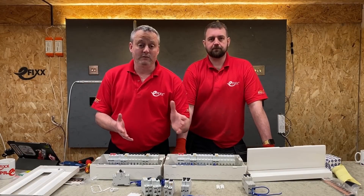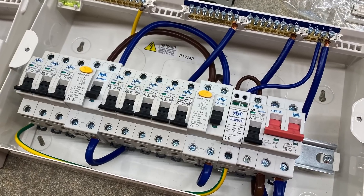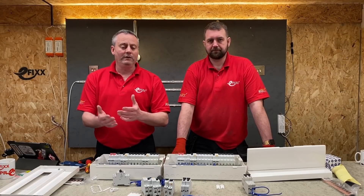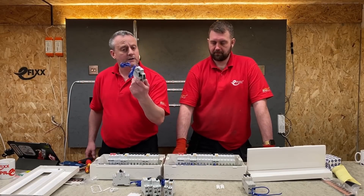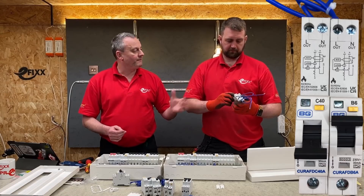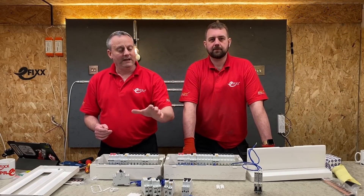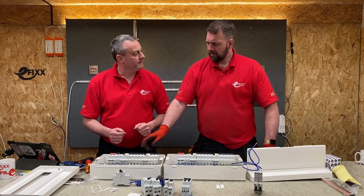The Fortress range has many configurations and variations - I'll leave a link in the description so you can explore it yourself. I chose a fully populated one with nine breakers, a surge arrestor, and two RCCBs already installed. However, if you want a different configuration the Fortress range has got you covered - you could choose the appropriate RCBOs for your loads. They've also got you covered with an AFDD - an Arc Fault Detection Device - and under the 18th Edition Amendment 2 of BS 7671, certain circuits in certain locations will require an AFDD.